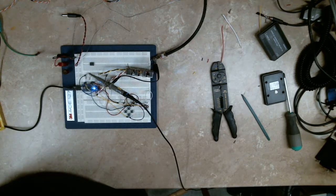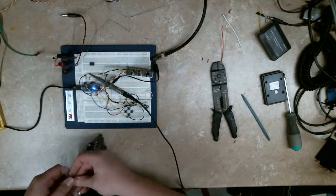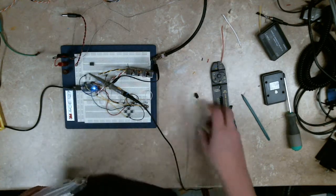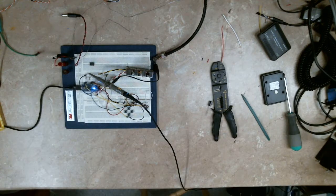75 ohm resistor to ground on composite video and 220 microfarad capacitor in series with a note. 220 microfarad are polarized. Well, yes, they are. Thank you, Mr. Obvious. All right. So, it says in series with the output. Just so happens that 220 microfarads is a common value, which I keep 100 of in stock. I would suggest you do the same.